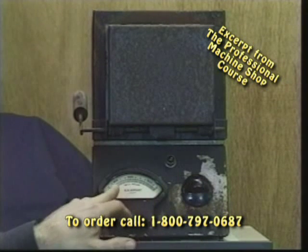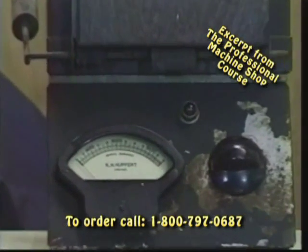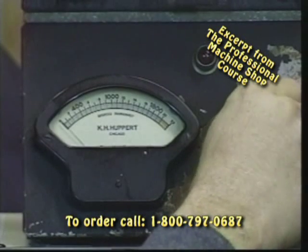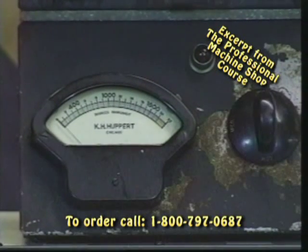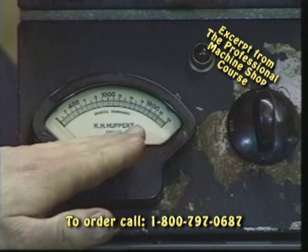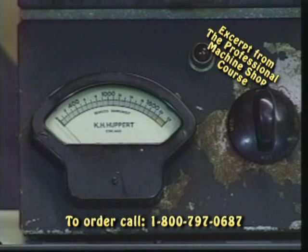It's got a temperature control here and a really nice gauge that's graduated in 25 degree increments. So we simply watch our needle and use our dial control here to adjust our temperature settings. Once the part is allowed to soak, we're basically going to stabilize our heat temperature at that point and allow it to soak for whatever designated time we have based on the alloy that we're heat treating.